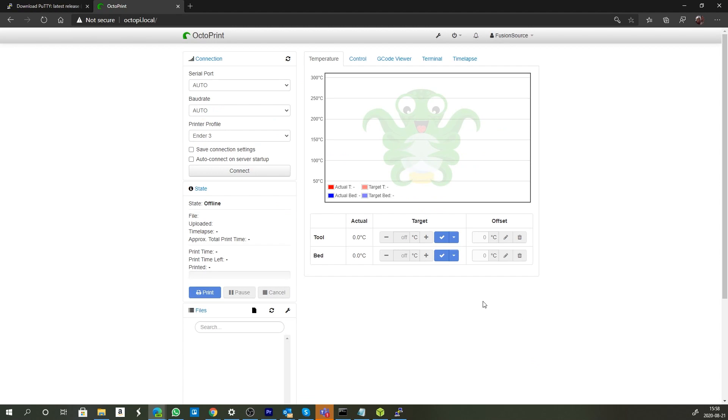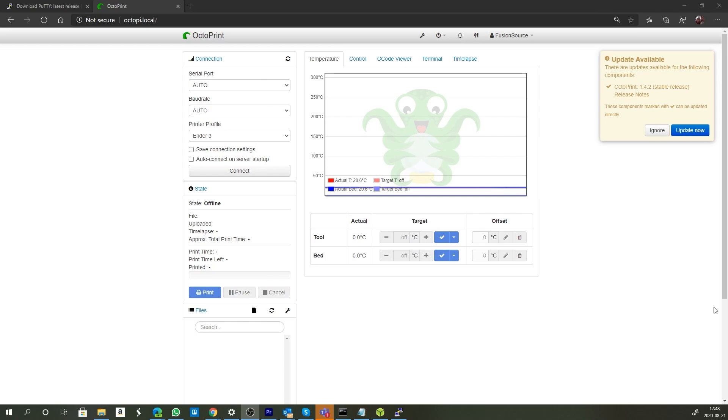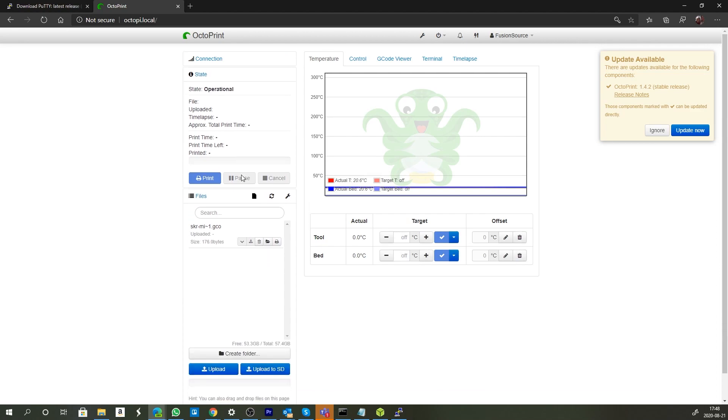It will automatically log in and you can see it has selected the Ender 3 printer profile. We can now plug in our USB cable into the printer and turn the printer on — it does automatically turn on when you plug it in via USB power, but it's better to have your normal power. Turn that on and click Connect. Once connected, you'll see temperature information for the bed and the hot end, and you have full controls. You can plug in a webcam for remote monitoring. You can move X, Y, and Z — and as I'm moving the controls my printer is actually moving. I've got full control of my printer now and can upload directly to the Raspberry Pi and print.